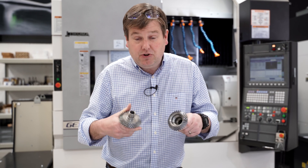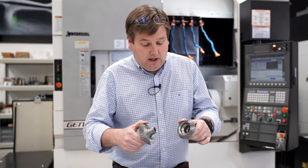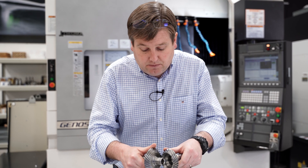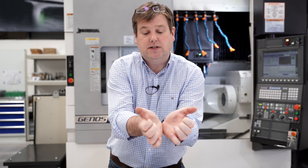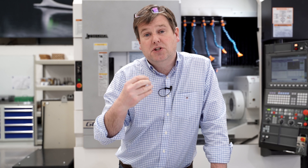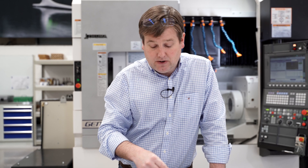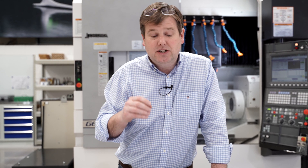For that reason you need to make sure the teeth are very accurate. But much more than that, the loads passed from tooth to tooth rely on the teeth being able to create a large contact patch that you control very carefully to keep the stresses — not only in the surface but in the subsurface area of the tooth — to a tolerable level for the material. So for all of those reasons, it's absolutely vital that we control the tolerances of the manufacturing process to an extremely high level.